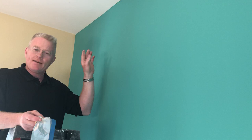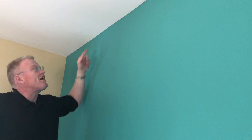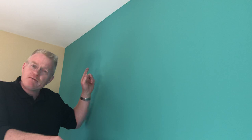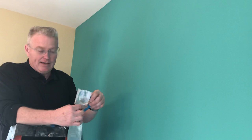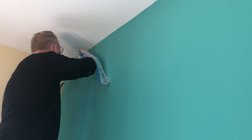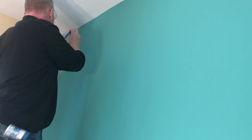I'm cautious about tape on paint. A lot of painters cut corners — they don't always prime in corners because it takes time. Over the years I've learned that the most vulnerable points on your ceilings and walls are the corners. Sometimes the only layer of paint there is the finish color. On a new construction job, if you don't have a primed corner, you can pull the paint off with some of the plaster and then you've got a repair to do. We happen to be in a very high-end home right now, so I'm going to take the chance and cover the ceiling with this plastic strip.